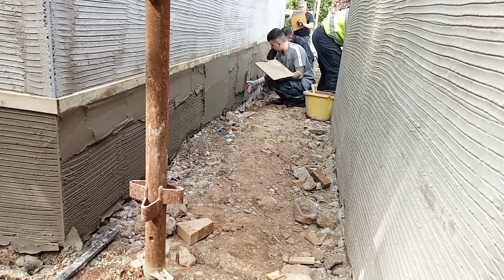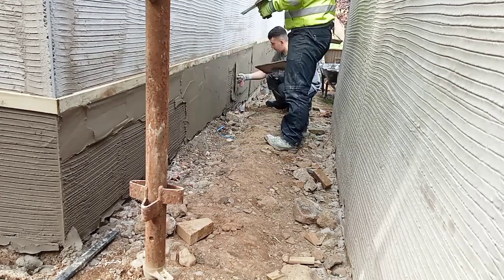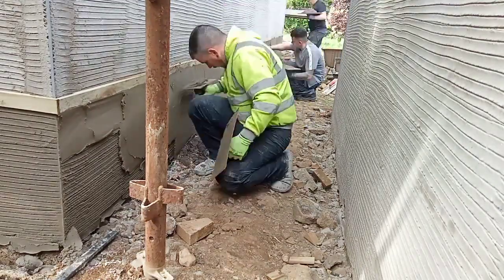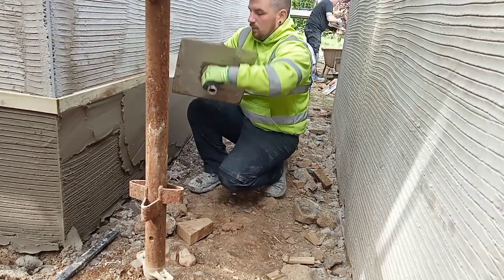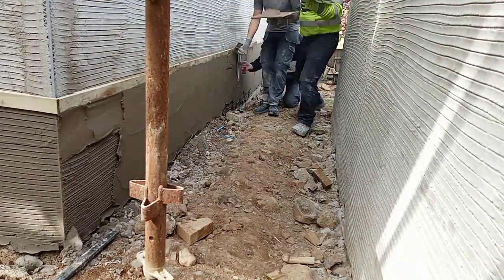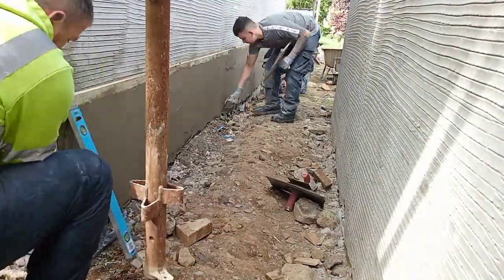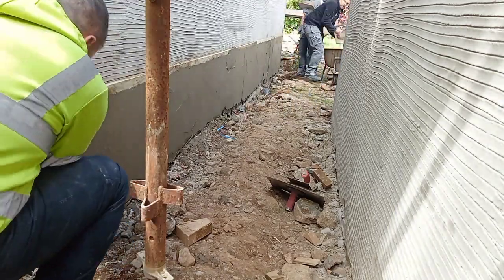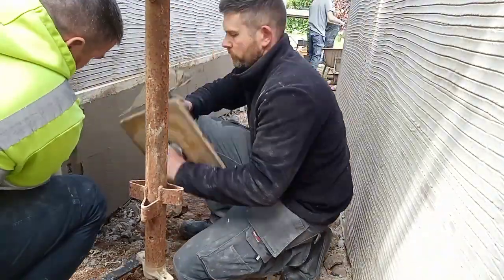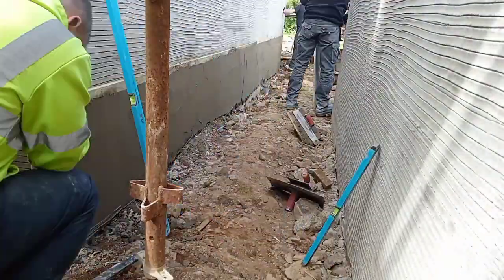We then proceed to coat on top of the scratch. What we're going to do here is to build our coat out as deep as the lath is above it. This is because we use the lath as a guide for our depth. And once we have this coat built right out, we just start to straighten the base.